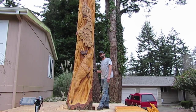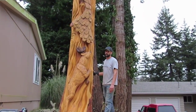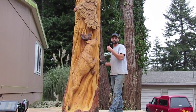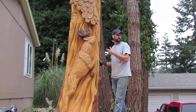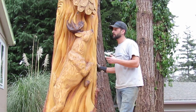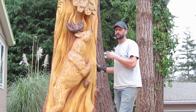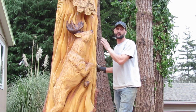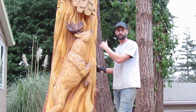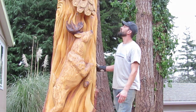The Doug fir is a little bit tougher, especially with the knots and the hard spots. It tends to chip and want to flake and get little chunks. But if you prepare for it, you can take a little bit less off with the chainsaw and take it off with sanding. That way, you don't do too much damage in the areas you're wanting to keep.